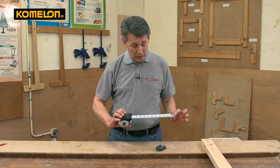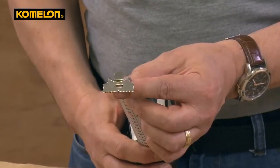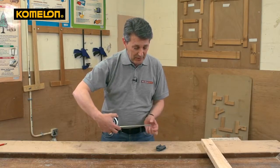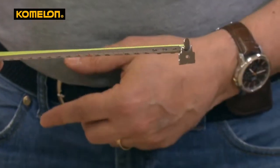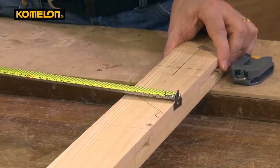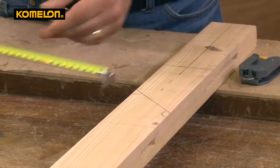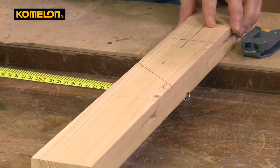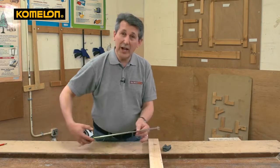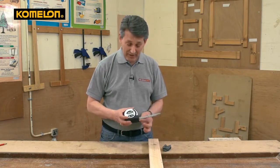Class 2 — obviously a proper quality tape. There's a lovely big end hook on there as well, a nice steel end hook very accurately placed with three rivets. It's got a slight up and down to the end hook. The beauty of that is if you're putting it on top of something it works like a normal tape, but if you need to come underneath something to take a measurement, the up part allows you to do that as well — so lots of little features that make this tape a little bit different to the norm.